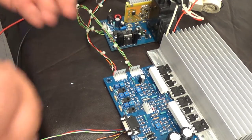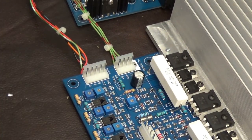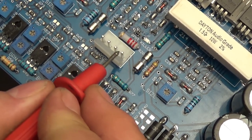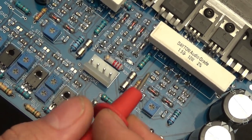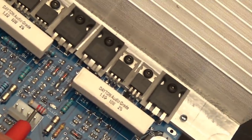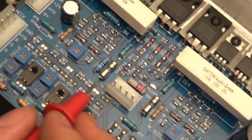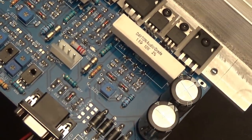Remember how I said I don't care about what X and what Y is? Each pair of pins is X or Y. If my picture is a mirrored image, all I'd have to do is swap these two wires. Or if it's upside down, I'd have to switch both sets of wires. Long story short: even if you have your inputs wired incorrectly, you can still mess with the outputs to make a proper picture.